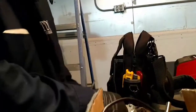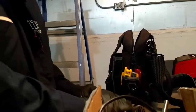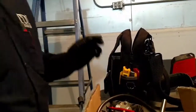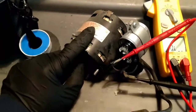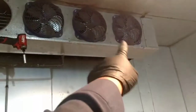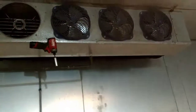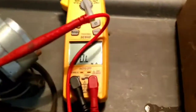Now let's look at the start windings on the old motor. The start windings on the old motor — look at that, open line. Bad motor. Bad start windings. That one's doing the same thing, that one's doing the same thing. That's the only one that's good, but the customer wants me to replace every single one. Quick video — bad open windings.